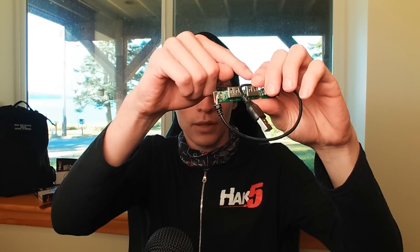That tells me the system-on-chip is alive, but none of the peripherals. Because on this board, on the Mark 7, two of the Wi-Fi interfaces go through a USB hub chip — basically just on a PCB without connectors, with the Wi-Fi cards effectively directly wired to it. So I take it one step further, get my voltmeter out, and check for power on the USB hub. And I do have power. That tells me I didn't just fry the voltage regulator or power circuit — I actually ended up killing the USB hub chip itself. It's still getting power, it just don't worky.